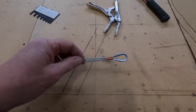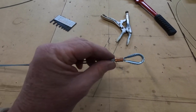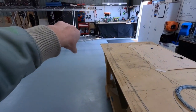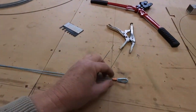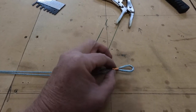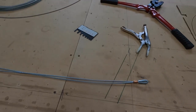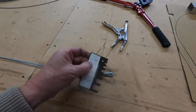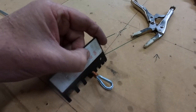110 inches I worked out. We'll crimp that up, fit some turnbuckles, rig it up and we should be able to make some airplane noises. Crimping up my sleeve — for a 3/32nd cable, the book actually says just one crimp, but I've done two. On the others — the cross bracing, which was also 3/32nd cable — I did three crimps, it got a bit busy. So for the elevator, doubled over, I've gone with two. It looks quite nice. The go-no-go gauge for 3/32nd slips on there nicely.